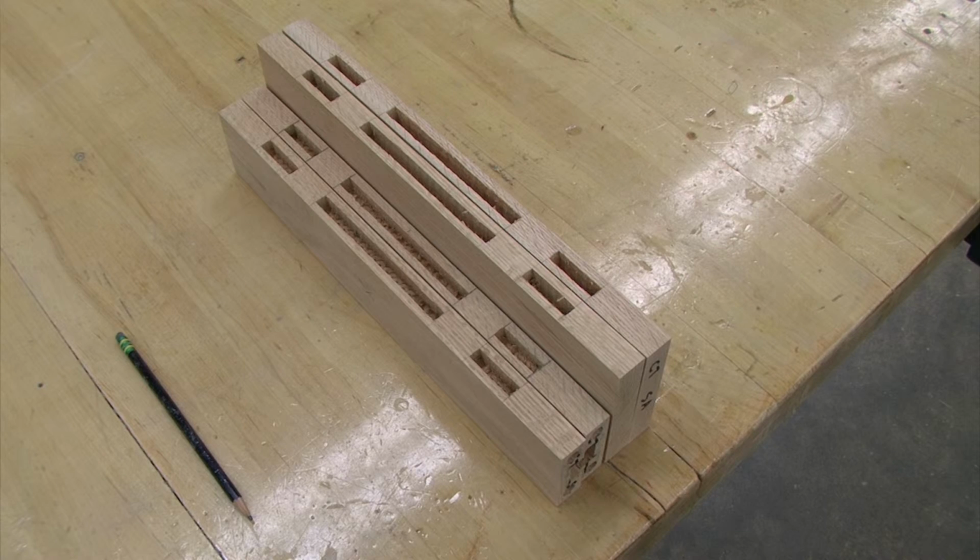When finished, we should have 3 mortise holes in each of our pieces on both the short apron and lower support. And because we transferred those lines with all of those boards clamped together, all of the mortise holes should line up between each of the pieces.